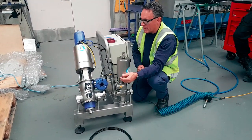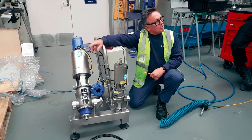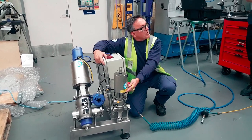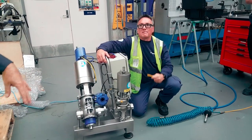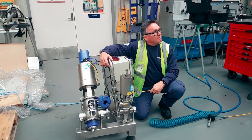Close it yourself. And we haven't used the HMI because we've got that critter in there that can come along and go, oh, there's a valve faulty. Turn it back on, you're in here, gone. You want complete control of that valve. So that's why this remote airline is here. That's basically isolating the electric. No one else has got any input in the valve now.